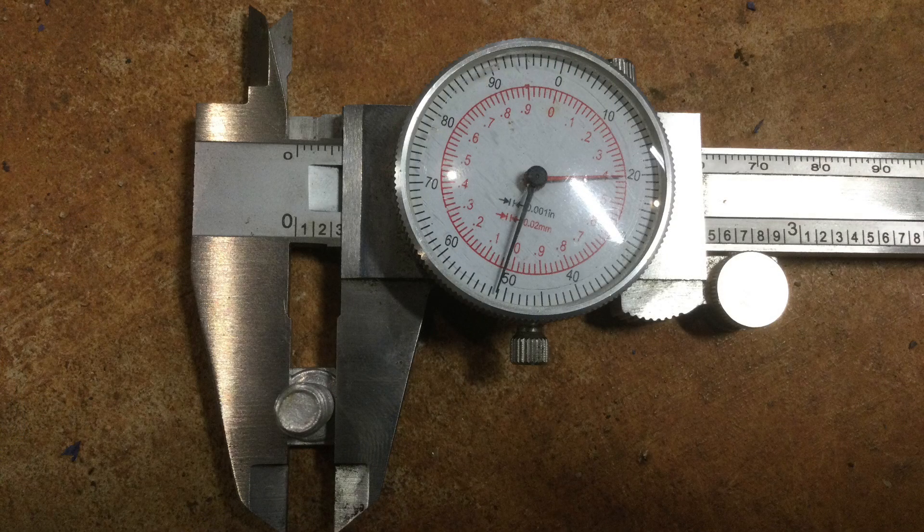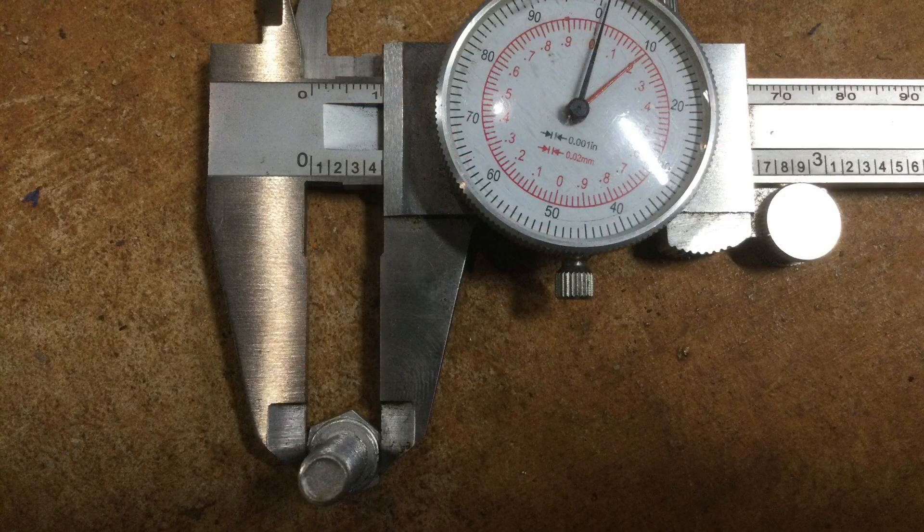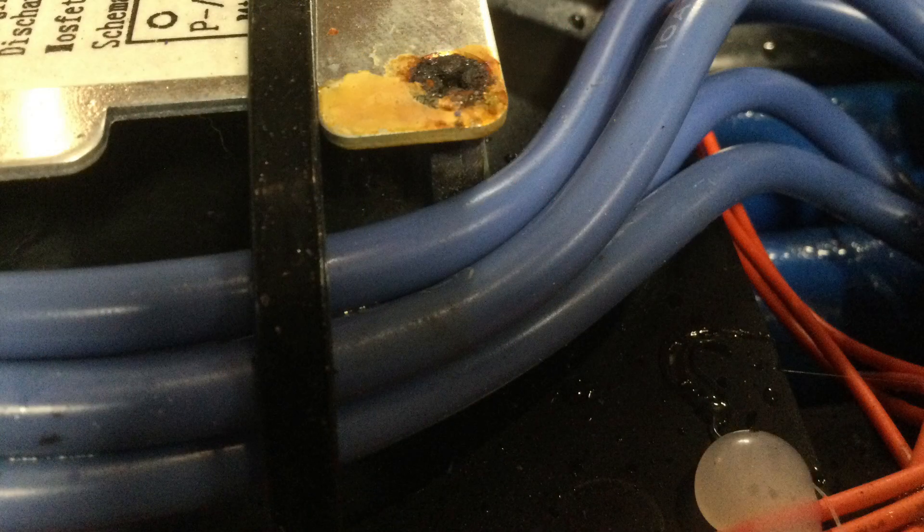Here are the measurements of the inner diameter of that raised flange that's making contact — I'll let you do the math — and here's the outer diameter. When I crunch the numbers and compare them to standard surface areas of rated lug connections, it seems a little undersized, which might lead to even more overheating issues.